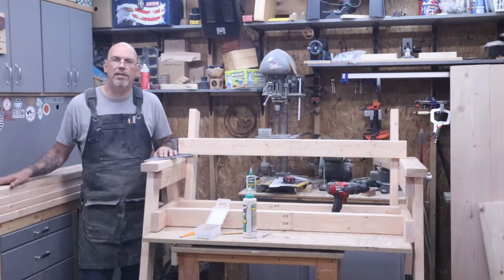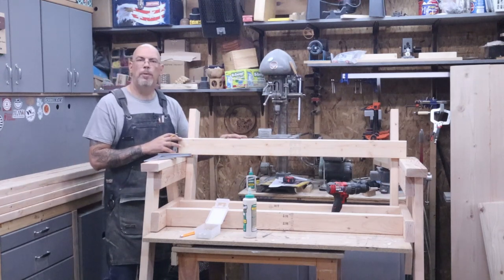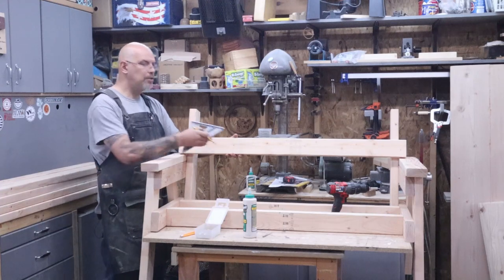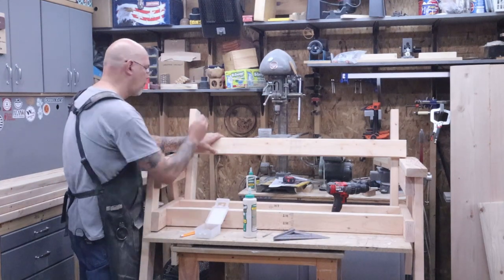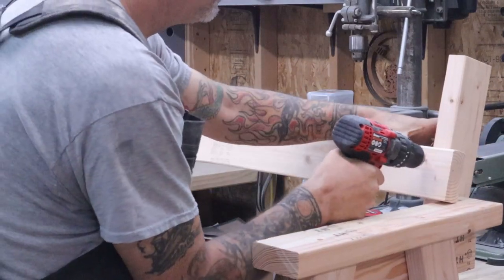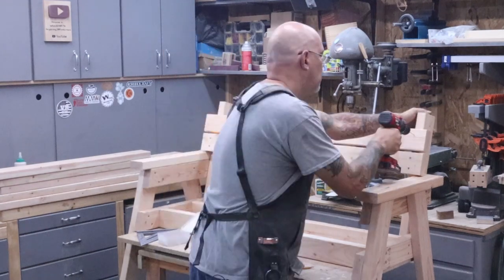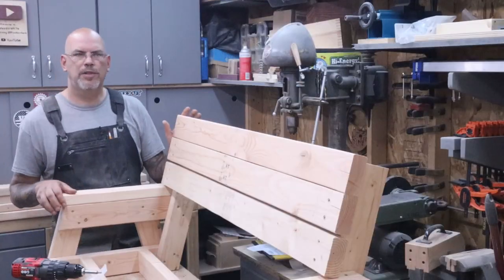We have seven pieces 47 inches long and one piece 44 inches. Take a 47-inch piece and put it across on the handrails — tip it back, even it out, and mark both sides. Then take your square, put it on here at the center of the 2x4, and make a line on both sides so our screws stay nice and straight and we know where to put pilot holes. Glue it and screw it on. Put the next board on top, use a square to line up screws on both sides, glue and screw it. Use pencils as spacers in between boards.